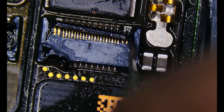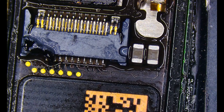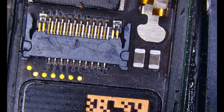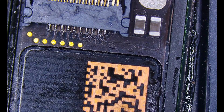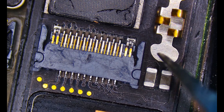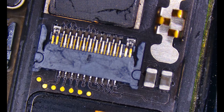Got that side done, and we'll do the other side the same way. Just in case I break this one, I do have the other flap I pulled that we can use. The reason I remove the flap is because I'm going to be heating this up and the plastic of the flap is much less heat resistant than the rest of the connector. We'll dry off the isopropyl alcohol and get ready for the extraction. This process can be done with any device — anytime you're replacing a connector that has plastic and metal — as long as you take your time and have the right temperature and flow. I'm going to set my rework station to around 350 degrees Celsius and take the airflow significantly lower than normal to get an even heat across this without burning any of the plastic.